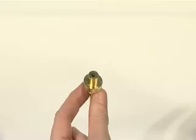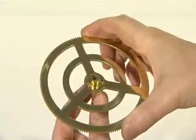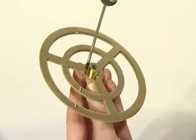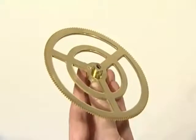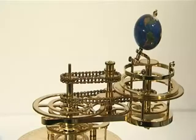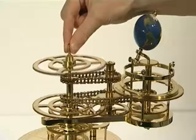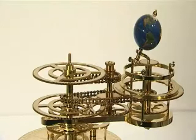The third phase of stage 7 adds parts supplied with issues 49 and 50. Fit the brass spindle to the 158-tooth gear using three KM 2.5 screws, ensuring the heads of the screws sit in the countersunk side of the gear. Place the assembled 158-tooth gear on the top of the central drive shaft and ensure it meshes with the 24-tooth gear on the central shaft.